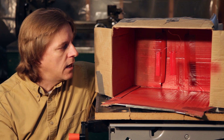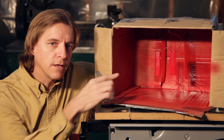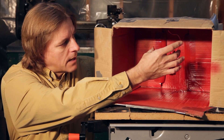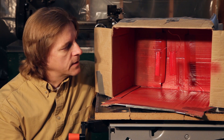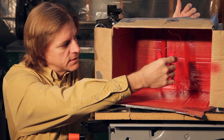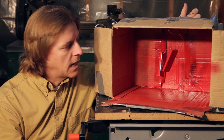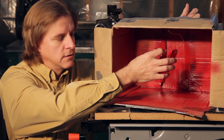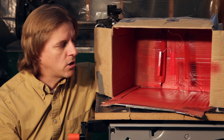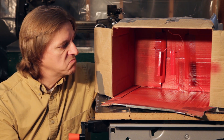I did have two issues. First, the box was a little bit on the small side and getting paint underneath on the bottom was a bit tricky. The second issue was when I first started, the wire was bent a little bit closer and the magnets would sway together and click together with wet paint on them — I had to pull them apart and clean things up, which was really messy. I ended up spreading the wires apart and didn't have the problem anymore. Overall, I'd say it was a success.